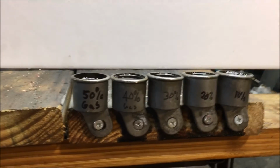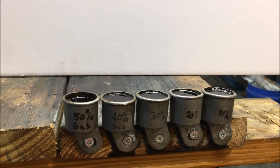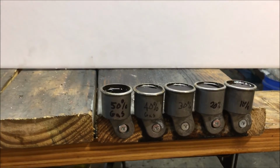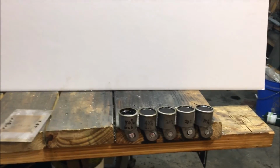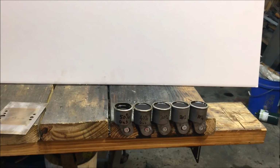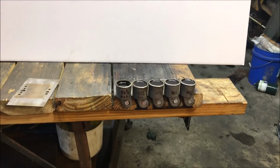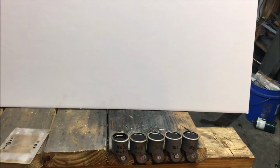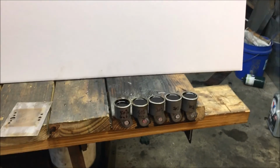So all you forge builders, listen to that, remember that it can take up to an hour to get a waste oil burner lit if you are not familiar with that device. So the first time, don't think an hour's a long time to get one of these things started. You have to learn the device. Most of the time it's too much air during ignition. I have found that I have had to reduce the air drastically while keeping a high amount of fuel input.